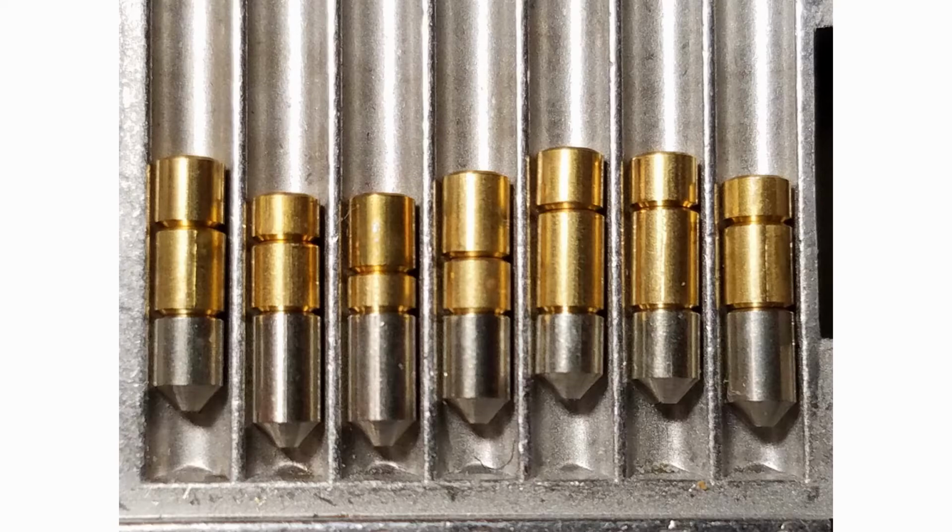Now going further in arrangement, I've arranged the pins. I've done that with some tweezers to make them all at a specific height. So I'm going to use the laser pointer here. Notice that these are all raised to what we call the operating shear line, because these silver pins all along here on the bottom are the actual key pins. They're nickel silver, and that's the standard for small format cores for less key wear. Above that are the top pins. Here's 2 pins, 2 pins, 2 more pins. Notice that there are 2 pins above each key pin, and they're just plain old brass.